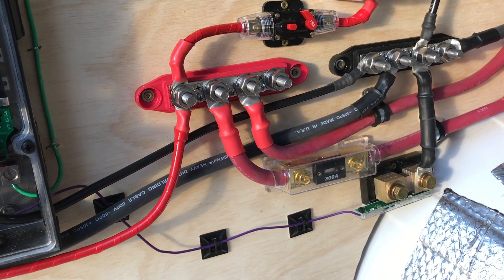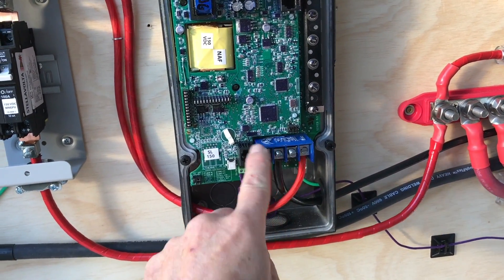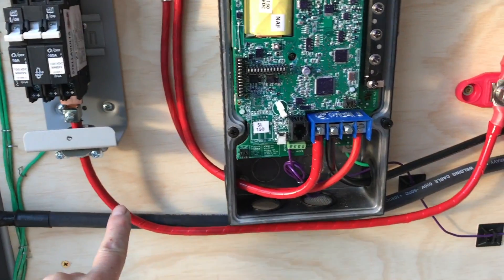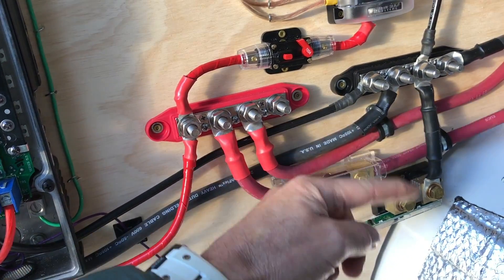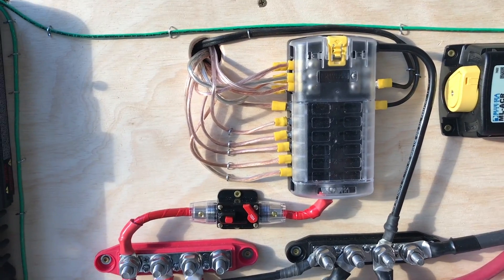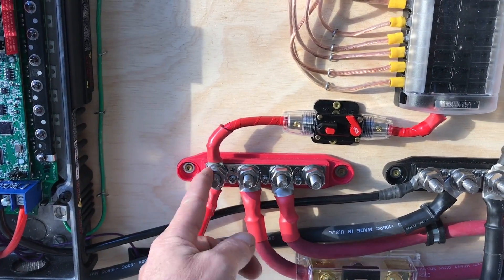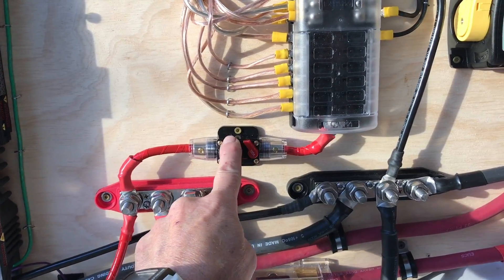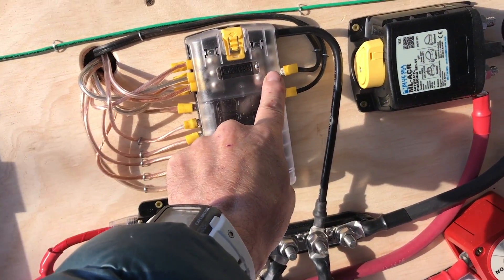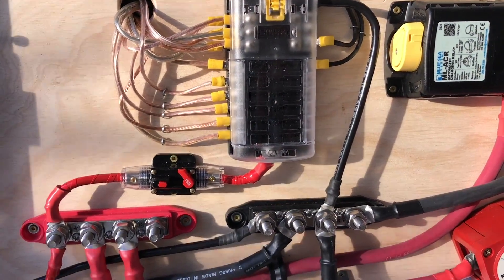All the batteries are tied together in parallel. Power comes in, passes to the charge controller, the charge controller sends clean power to the batteries — it goes through the breaker to the bus bar and then out to the batteries. Over here is the 12-volt DC panel that gives me all my different circuits. It's just passing one lead off of here through a 100 amp fuse and then through all of these circuits — all positive up top and negative down here. This is a Blue Sea panel.